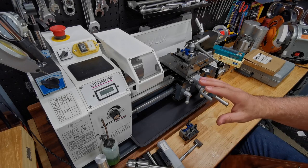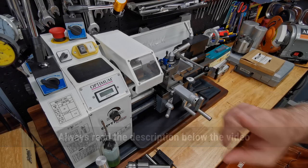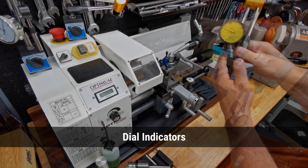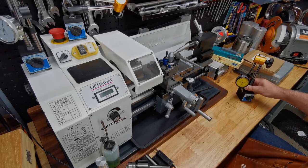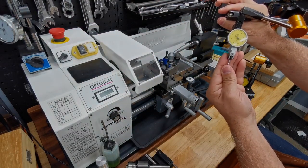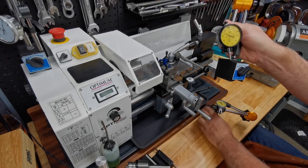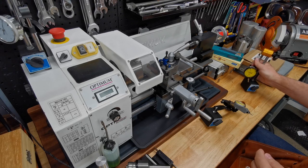I'm going to cover a few things I've already touched upon — I'll start with the dials. There are really two types: this kind here, which measures a linear amount, in this case just over a centimeter, and the dial test indicator, which only measures about a millimeter or so. The dial test indicator is great for finding runout — checking if something on your lathe is running true — but you can also do that with the regular one, just point it at your tool and it'll rock back and forth. Either is fine.